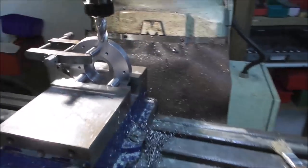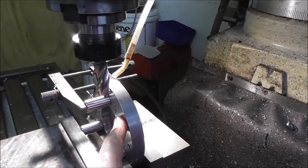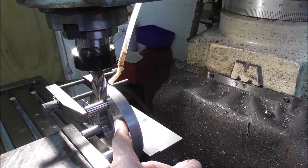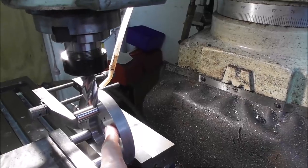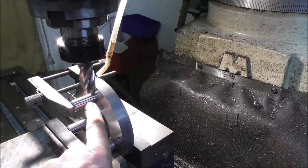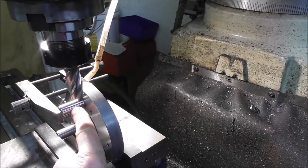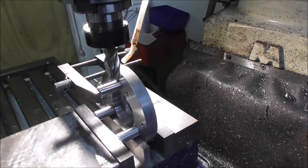The essential dimensions are that you have a 3/4 cutter, touch it on that face, back off 6.2mm, and then index in. Once you touch the stud, go in, sorry, start that again, back off 4.2mm, touch on the diameter, and zero your setup on that, and then cut in 6.2mm deep, and then slot it 1mm out, and then come out at 45 degrees.